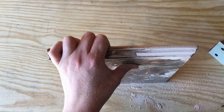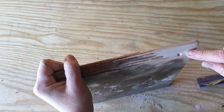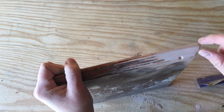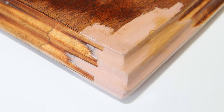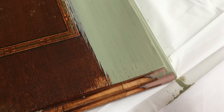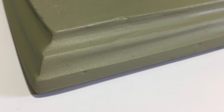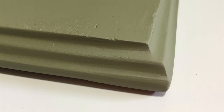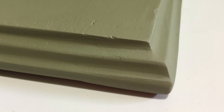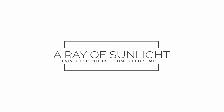I ended up with a little air pocket in the Bondo, which is annoying, but since it was such a small hole I just went back over it with some regular wood filler, let that dry, and sanded it down smooth again. I gave this board two coats of paint so you can see what it looks like all painted. There are still a few imperfections, but I personally like a little bit of imperfection — if you want it exactly perfect you can spend more time on it. Every piece of old furniture has character, and I like to keep a little of that. I hope this video helped — please subscribe for more tips and tricks about furniture!